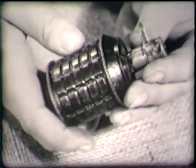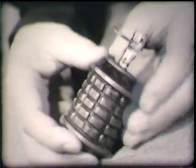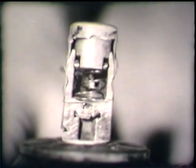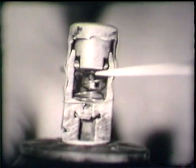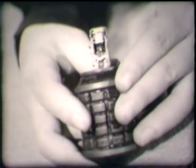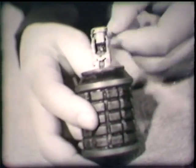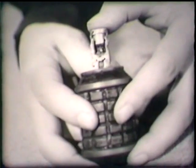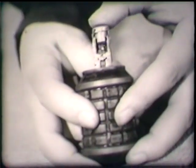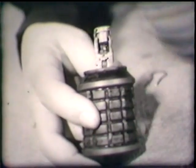This is the part of the fuse assembly containing the striker mechanism and safety pin. A cutaway reveals the striker and the safety pin which holds the striker in a safe position, also the retaining spring and the percussion cap. After the safety pin is removed, the striker can be pushed down onto the percussion cap. In actual operation, you must give the end of the fuse a sharp, hard blow so the striker will hit the cap with plenty of force. This is important since the striker isn't spring operated.